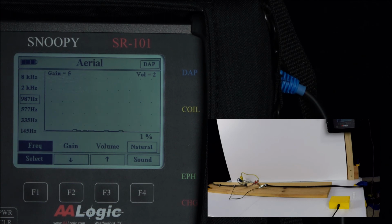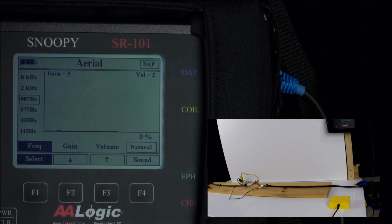Ground faults are more difficult to locate due to the cross-coupling of the signal to adjacent pairs. If the cable has a short or a cross, it's better to locate those. To locate the ground, connect one clip to the wire, the other to the sheath. Coil carefully, as there will be a lot of cross-coupling. The signal should decrease when you pass the fault. However, the decrease may not be as significant as you saw in the short. Careful coiling is required.